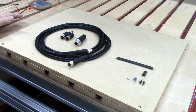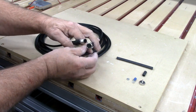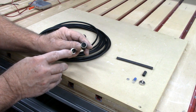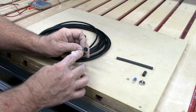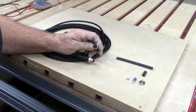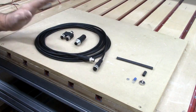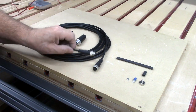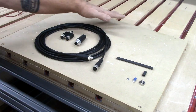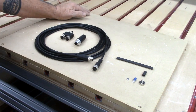In order to make this connection we're going to need a few parts. The first thing we're going to need is an M12 cable, four pin. I have an M12 four pin male end and a female end. These are a little difficult to find, so I've put links to all of these parts down in the description box. I chose a 5 meter or 16 foot cable simply because it will reach anywhere on my CNC table. You can use whatever length you'd like.